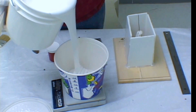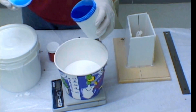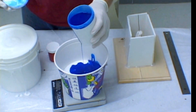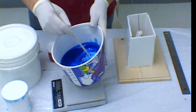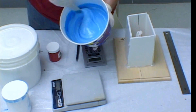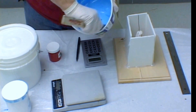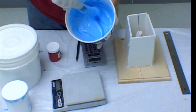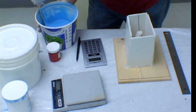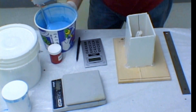This process is a little different from the way we make our rubber from the blanket mold. Our catalyst is a different color than the base rubber, so we have an easier time mixing the catalyst to the rubber. Regardless of that, you still have to make certain the rubber is thoroughly mixed before the rubber is placed into the vacuum chamber for de-airing. Take your time scraping the sides of the bucket, making certain there's no base or catalyst left unmixed.